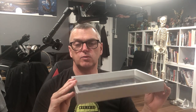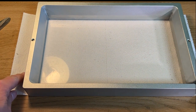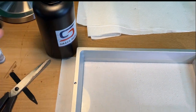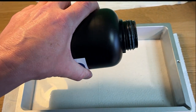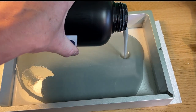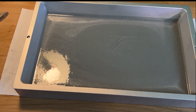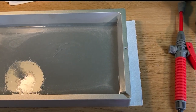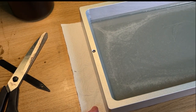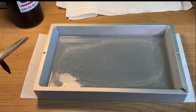One thing we want to do before putting it straight back is test it. Bring it over to a clean surface with a bright clean tissue or piece of kitchen towel underneath it, then get some resin and just pour a tiny, tiny bit in — just enough so it covers the entire base. Because it's on clean tissue you should be able to see if there are any leaks or holes in the FEP. Leave it for half an hour and then just lift it up and see if anything has leaked out. If not, you're good to go and can put it back in your machine.